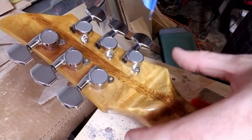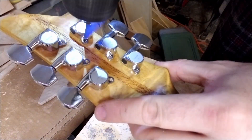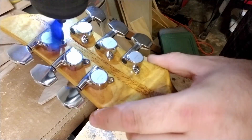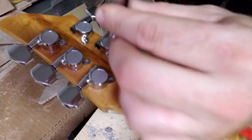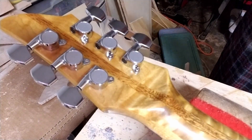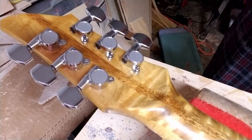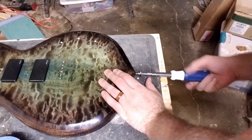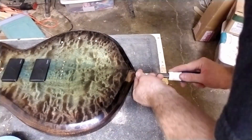Always make sure to mark your drill bits with a little bit of tape or something like that when you're doing shallow holes — definitely don't want to go too far and go straight through that beautiful finish that we just spent all that time putting on. And by the time we got to putting this hardware on, it really felt like this thing was coming alive.